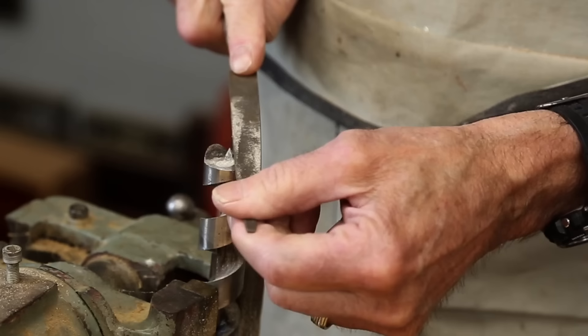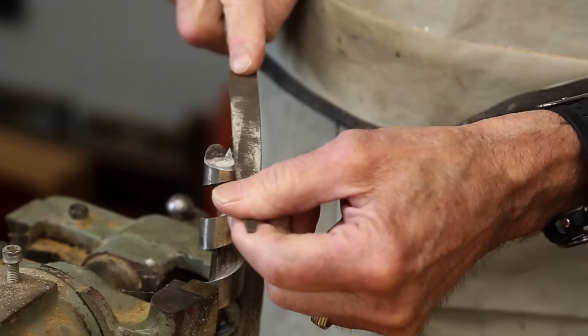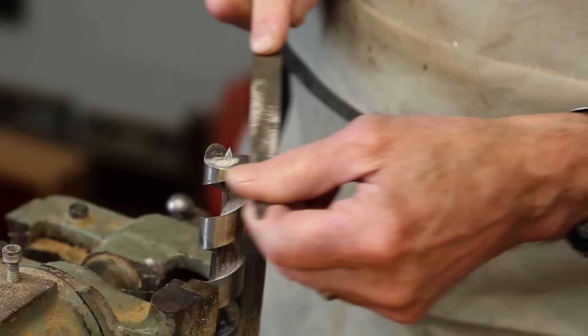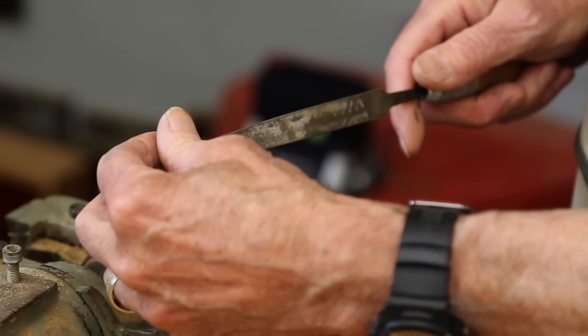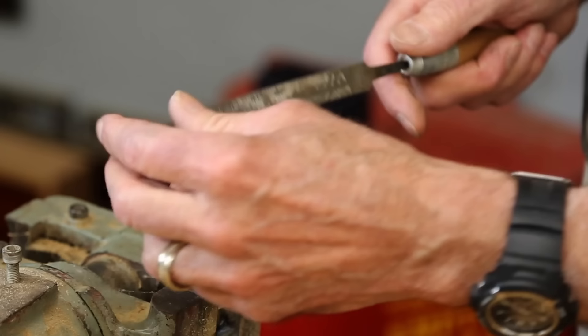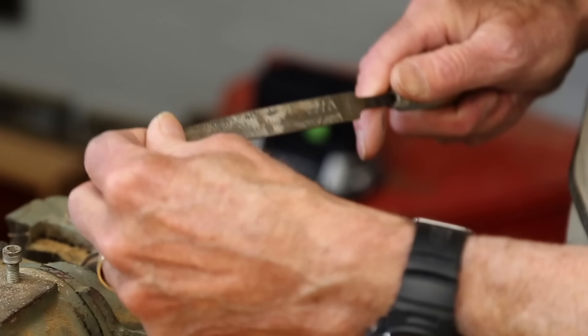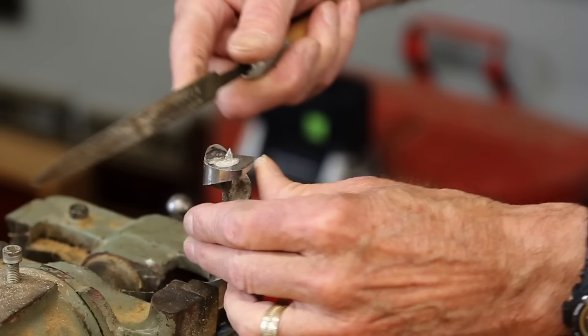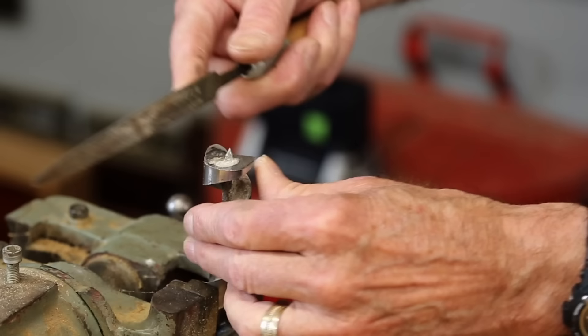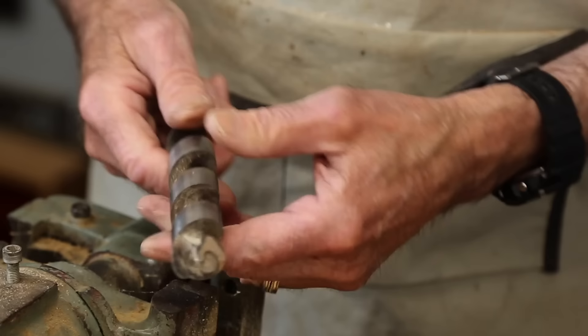A handle would make this a little safer. There — I've given some clearance behind that edge and have a nice sharp edge. I will now put the safe edge down in there. You can see there's a flat spot on the lip, and I'm just going to go in there like that. This warding file is a second cut, single cut, and second cut leaves a pretty nice finish behind it. There's our sharpened auger bit, ready to drill a couple hundred more holes.